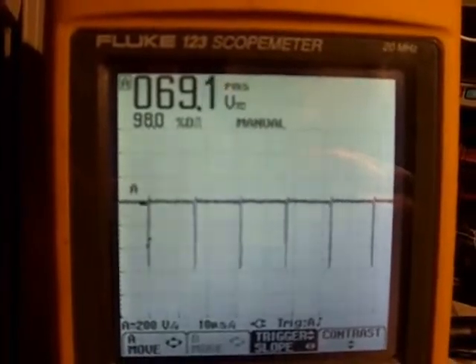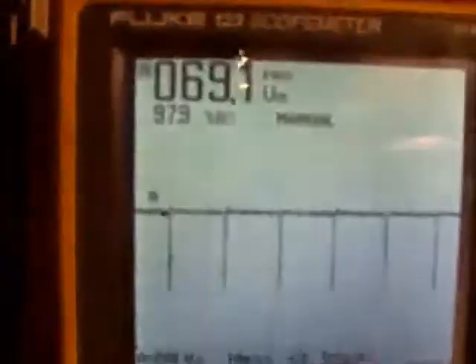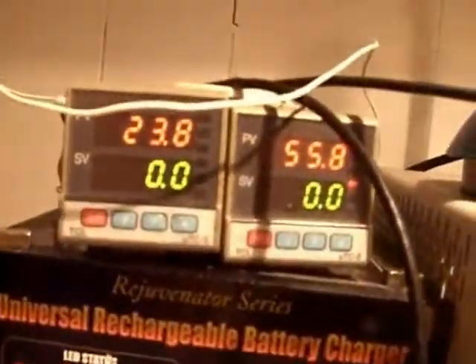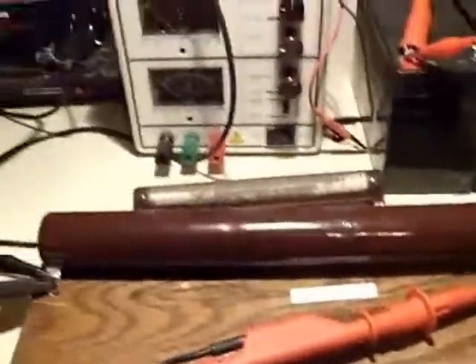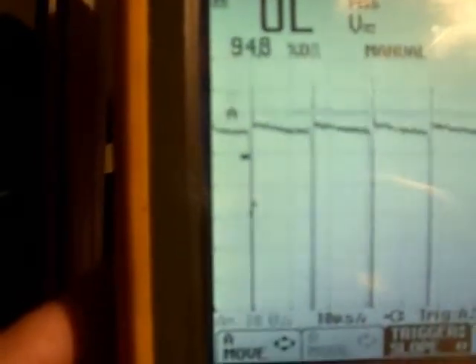If I change it so you can see the RMS, it's about 70, and the shunt voltage is about 250 millivolts at all these settings. Right now ambient is 23.8°C and the load is 55.8°C — I'm just going to let it sit and climb a little bit. These batteries are kind of beat down; batteries are at 20.46 volts. That looks like it's settling on zero, but it's really not, because if I increase it, it's not settling at zero. Everything looks good.